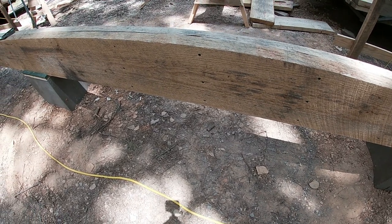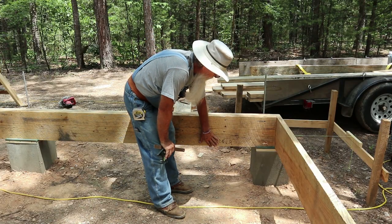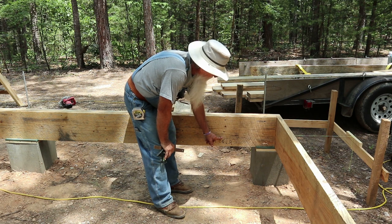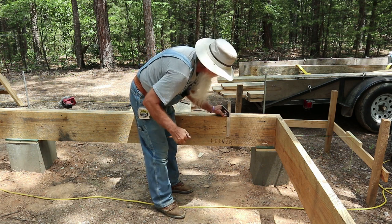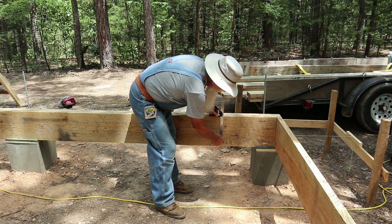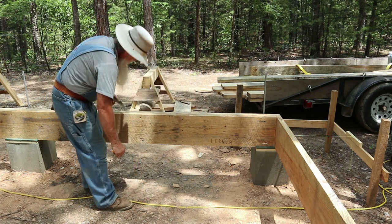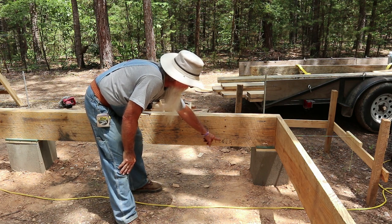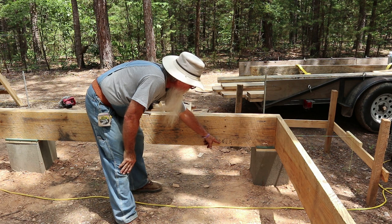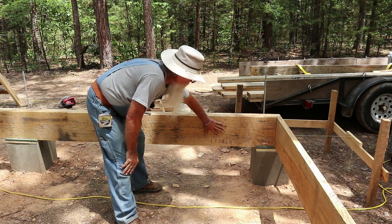I've already got my layout — I'm doing a 16 inch center. I'm going to put a ledger down here on the bottom and I'm going to hold the top of it down seven inches from the top edge. I just set my combination square at seven inches and I'm going down through there describing a mark, and that will be the top side of the ledger. I'll go all the way down the length and make that mark, then I'll rip a three inch piece and screw it on down here at the bottom. The joist will be notched out over that ledger and it will give it some extra support — otherwise I would just be depending on the nails in the ends of the joists, but with it sitting on a ledger it makes it stronger.